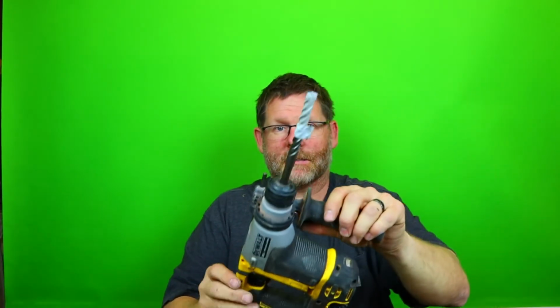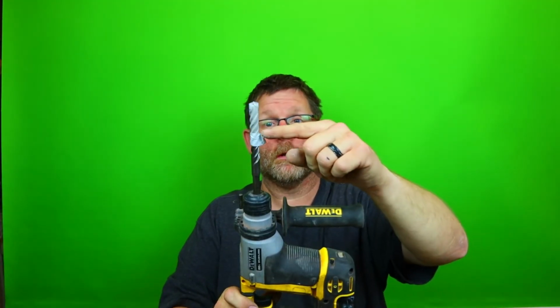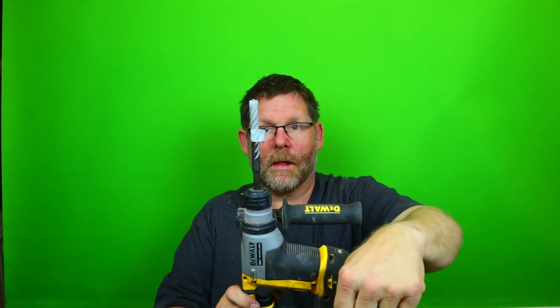Make sure you have the right bolt. The bolt length matters. You don't want to put a 4-inch bolt in here and have to put 26 washers on there. Make sure that you get an SDS or a drill bit. Make sure you put your little tag on there. This is important. You want to go the right depth. Then clean your hole out. Then drop your anchor in. Then use your setting tool and your hammer, bam, and knock it in.